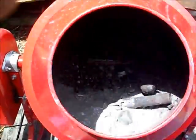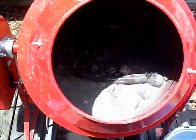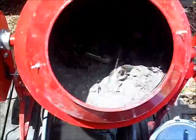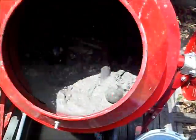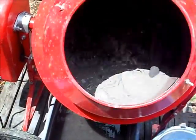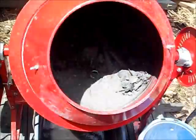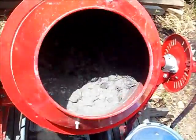What I've noticed is that after a while, when the larger chunks are milled and the powder begins to collect, it'll start sliding. It won't move the material around for the balls to work, and I have to adjust it to a steeper tilt to make it mill again. It won't take but about an hour before it just starts sliding and not really moving.